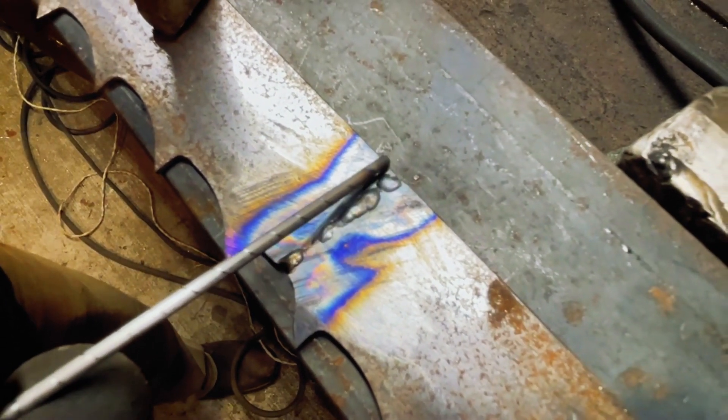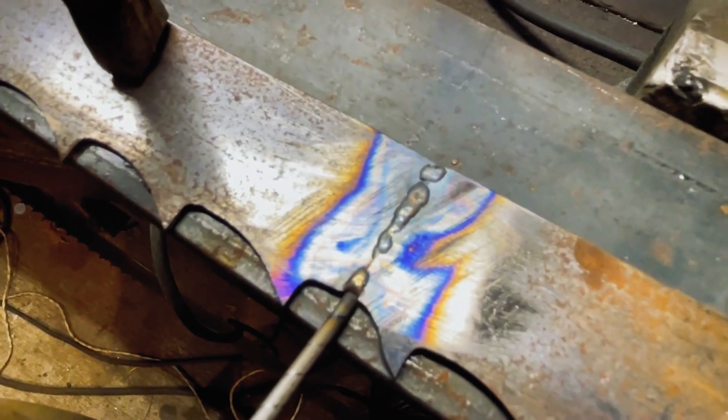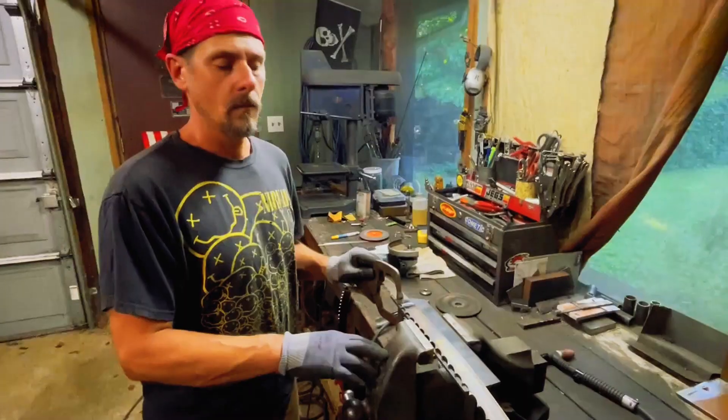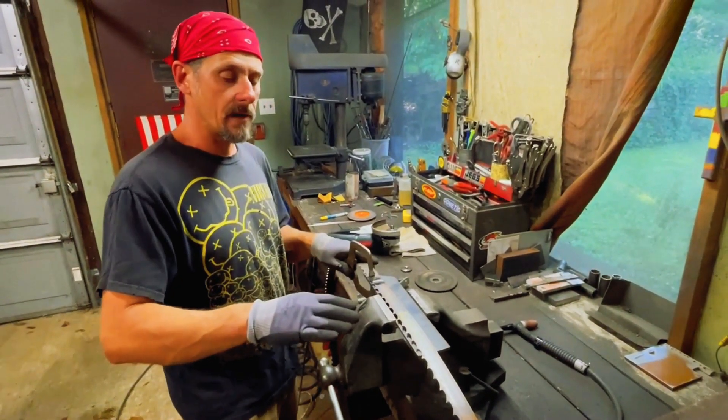On the end you don't want to hit it hot and heavy because it'll wash out on you. Here's a good example — on the front I got it too hot and had to build that back up. It's a lot easier to maintain it versus washing it out and building back up. That welded up pretty good — actually a little better than the carbon. Got them labeled and I'm going to knock this weld down, then we'll field test.